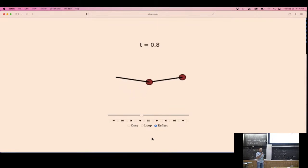Okay, so do you understand what's happening here? Two-link pendulum, they just happen to have exactly the same length. It makes the kinematics trivial. It means I can write down the Jacobian. It's a 2x2 matrix. It's super simple. And that Jacobian loses rank when the Q's are zero, like this, when it's straight out. Okay? And I'm just telling the robot to go through Q as a sine wave, basically. Q1 and Q2 are sine waves of scaled magnitude so that they stay perfectly in that line. Okay? It's clearly going out and coming back. It's not like it can't come back.